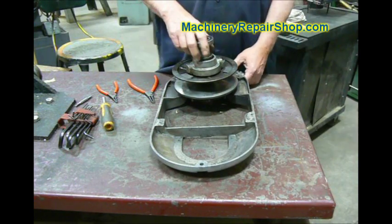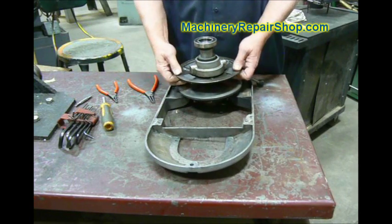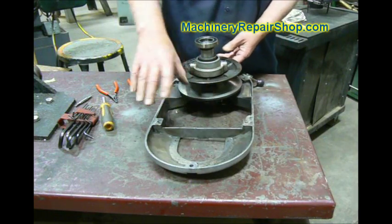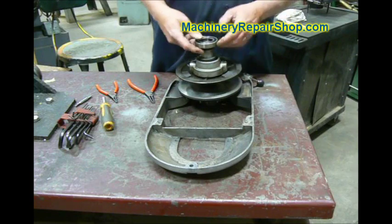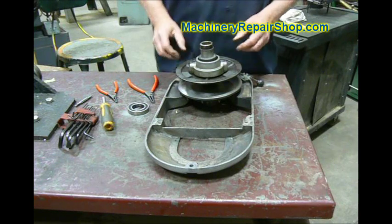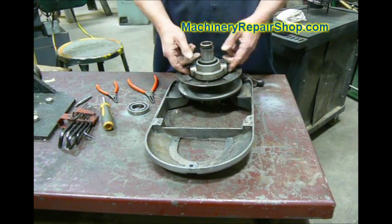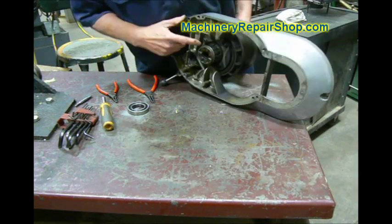This is the middle section that we just took off. It contains the front variable speed pulley — the pulley that moves up and down. The chain pulls down and varies the pulley ratio between this and the motor pulley back here. This assembly contains three bearings. We're going to replace all three of them. The first is the top one, which sits in that plate on the top. There's a bearing underneath this collar that moves the pulley up and down, and then there's one underneath that supports the pulley.